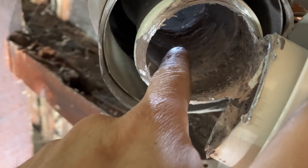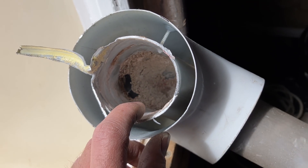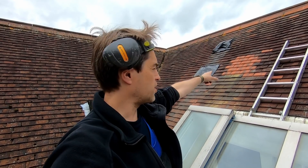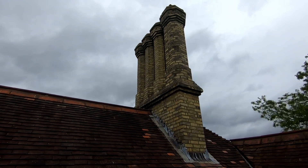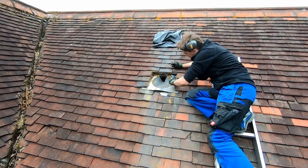Look at that — it comes from the flue I'm just removing. If you look inside the flue, the boiler has been condensing. It's all wet, and this is corrosion that has eaten into the aluminium flue liner. That pretty much tells me the flue run was probably too long, and the products of combustion were cooling too much before they reached the end of the flue and condensing inside. So now we have a roof to repair. I've already repaired one flue — you can see the different colour tiles there. I'm going to reuse the top one and still have to repair this one. I'm carefully removing mortar, trying not to lose any more tiles and remove the flexi-slate.